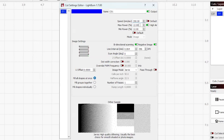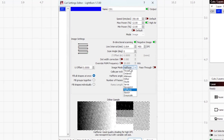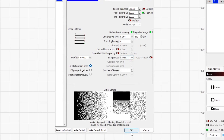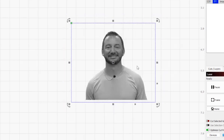I'm going to do 350 speed and 12 power, 400 DPI, and I'm going to choose the image mode — this is the dithering mode. This is how the actual dots are rendered; there are different algorithms for how we do this. Jarvis is a good jack-of-all-trades option. Click OK, and then I'm going to resize this to about three and a half inches.